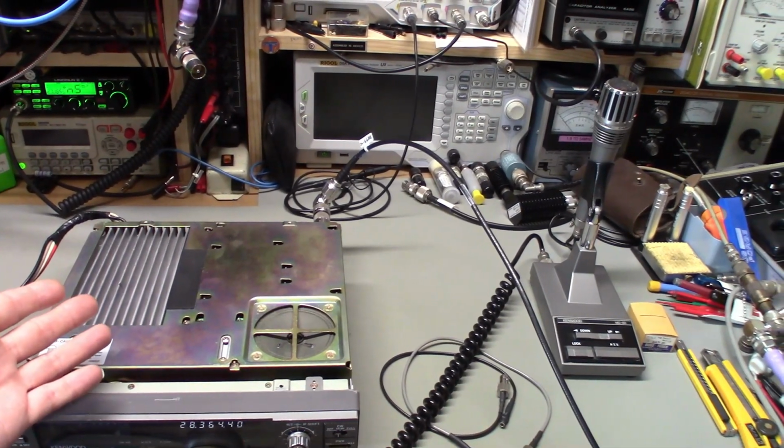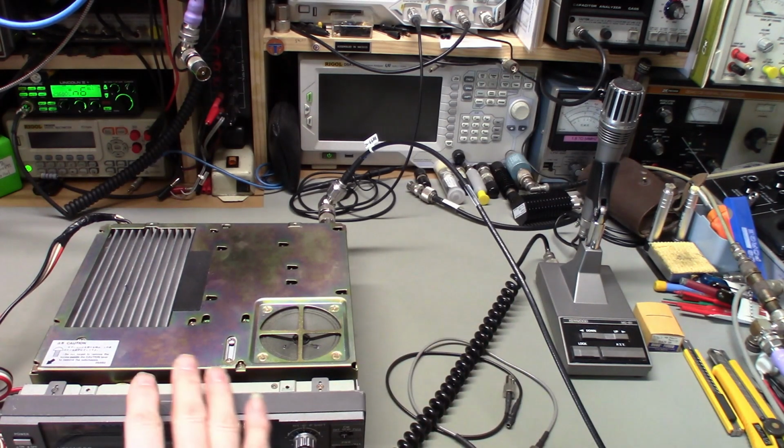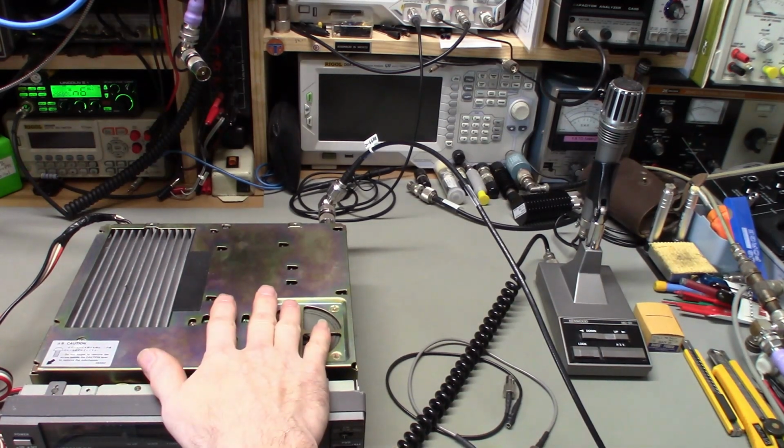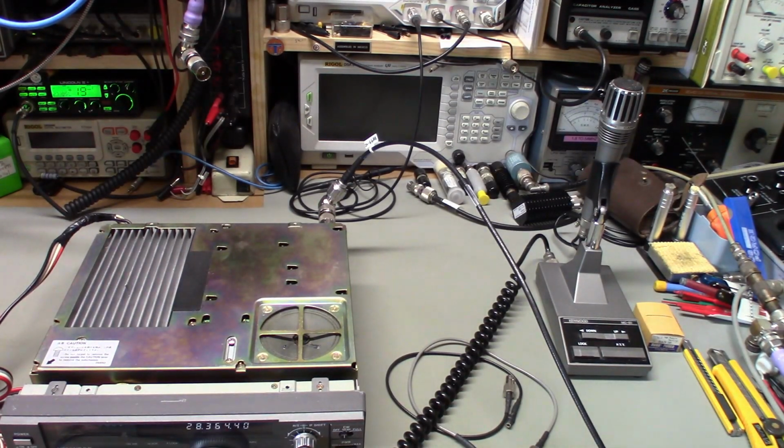And the easiest way, honestly, to heat test a radio, instead of having to sit there and just talk for 5 or 10 minutes, is just turn on some music. Music has a really high duty cycle. Unlike what I'm doing right now, talking, and it's actually the reason when you're doing sensitivity adjustments on a radio, they tell you to apply 30% modulation, because that is basically the average output power from your mouth. If you average what's coming out of your mouth, sound-wise, over time, it only peaks about 30% of the time.